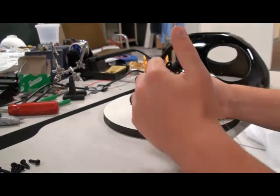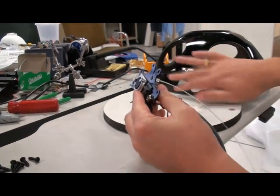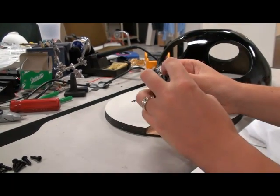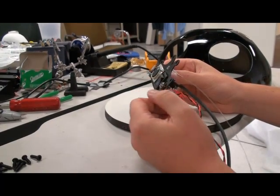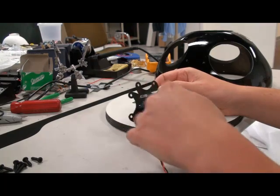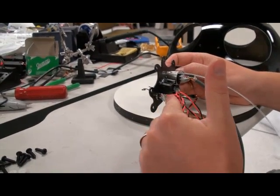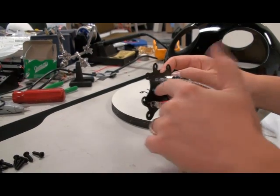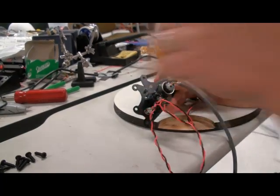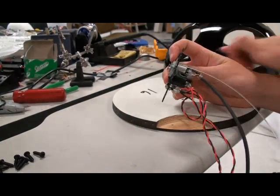This panel is plastic so it's a little bit bendable, which works great because these pieces are not curved like the surface of the hemi speakers — so it allows for correction and lets stuff sit better. One thing we also did is we gunked up all of the connectors simply to remove any possibility of them shorting out, particularly this one here. On the switch, we found it's good to put a little bit of gunk on both ends because otherwise the edge will extrude where it's flat against the curved surface.